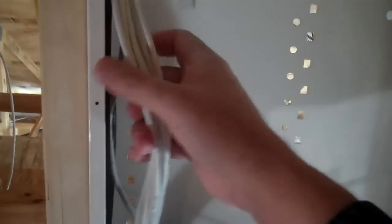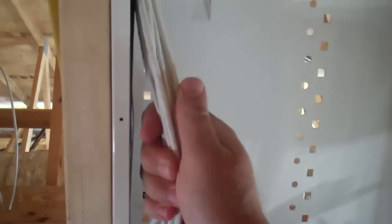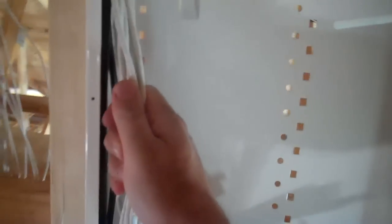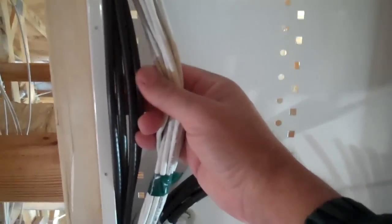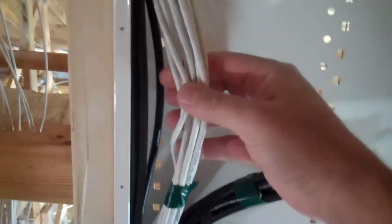It's okay because we're not putting a lot of stuff inside this can — it's just used to keep things organized. We have all of these Cat5s: two come from outside the house to bring phone service in, one of which is a backup. We have four coaxial feeds that go outside the house, which can be used to bring in cable service or satellite service. On the other side we have all the coax that go to the various jacks throughout the house, and we just zip-tied them on the side so the customer can finish those out when they move in.